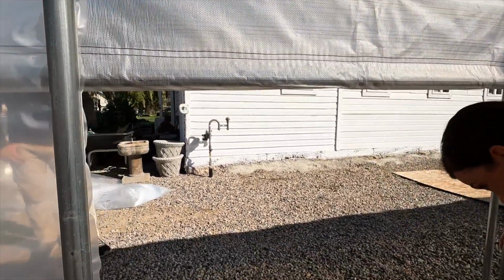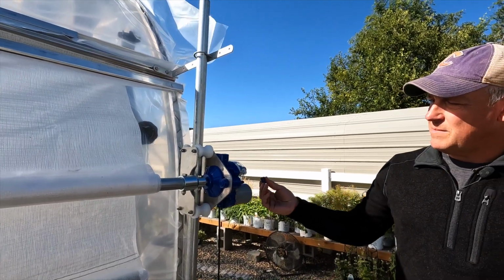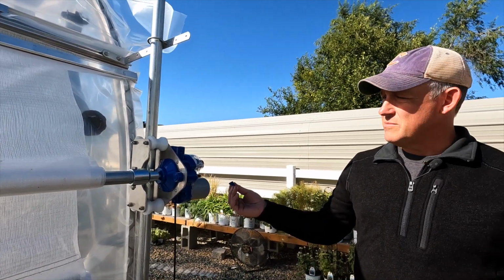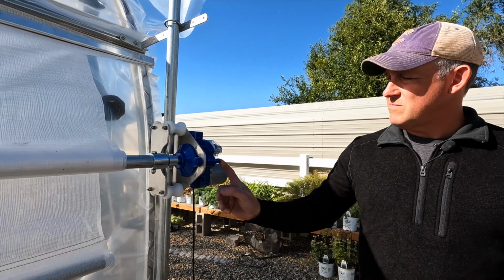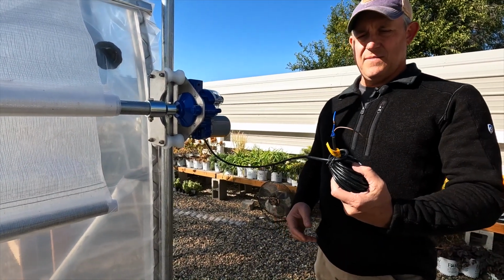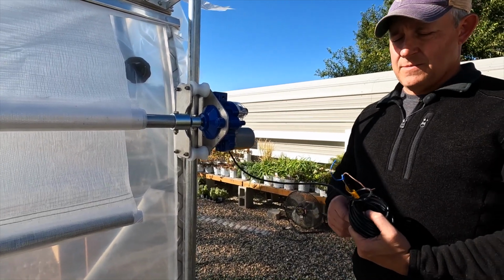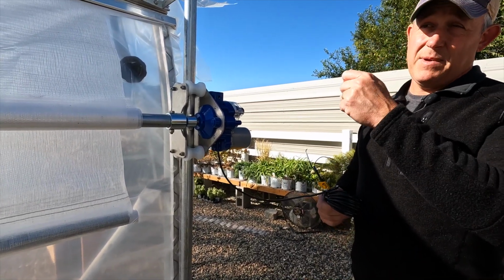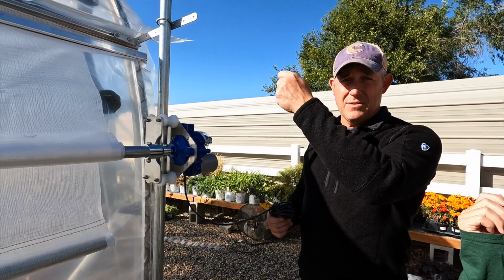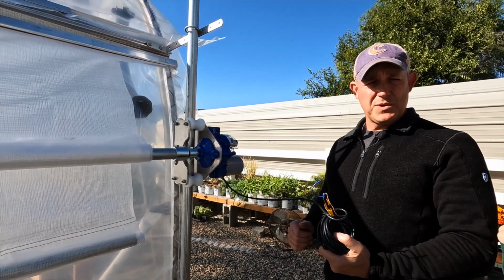It's fantastic. And that's the motor right there. Yeah, this is the motor. So now you can manually control it with a cordless drill to get it up and down. And then we'll have to have that wired in as well. Yeah, this is the wire. There it is. I go to the vent boss, and there are 2 locations for both motors. And even when you have electricity, you can manually tell it to come on just with a switch without relying on the thermostat to tell it to come on.